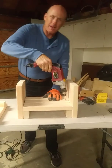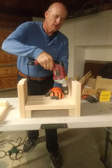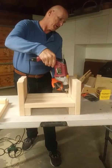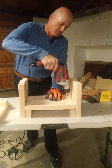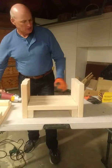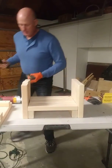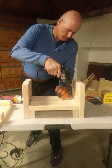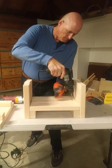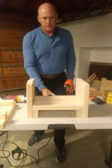I need to drill here, and I'm going to angle this a little bit because I want to start here and not run into this side. So I'm going to angle a little bit and make sure it goes into this support runner — just like so. Now I'm going to take a two-and-a-half-inch screw and put that in to hold it in place.